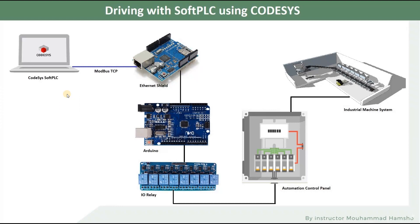So what's required here? A computer, an Ethernet shield, and an Arduino Uno — we're going to stick to Uno here, so please stick with Uno because I'm not sure how this will work with other boards without some tweaking, as I didn't test it with other boards. We also need a set of relays. You can use small relays; you don't have to buy a six-channel module. We can use simulation to see how this stuff works, but I'll also make some demonstration videos to show how signals are actuated in the automation panel and how feedback comes back.